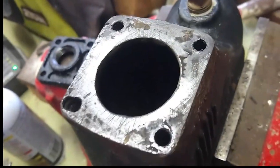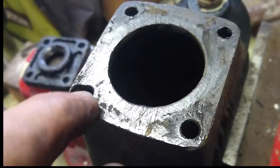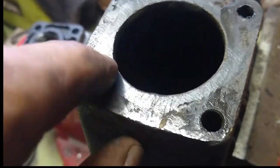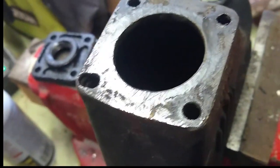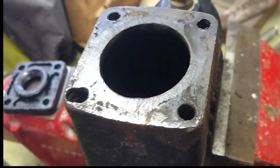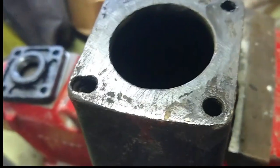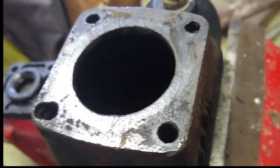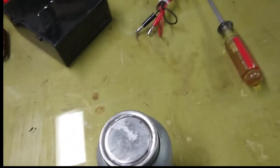I should also mention that the one screw I had to drill out — my drill bit walked on me, so the hole is not complete. But I've still got threads around probably two-thirds or three-quarters of the hole, so the bolt goes in just fine. Any time I'm putting together anything like this, I always use anti-seize compound on the bolts before I put them in. It really helps to get bolts out years later. The one I happen to have is Permatex, but any brand works.